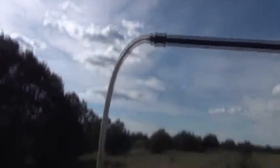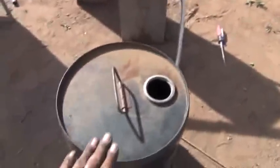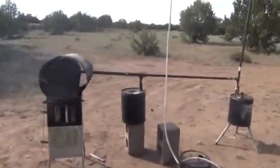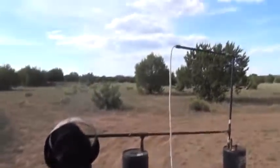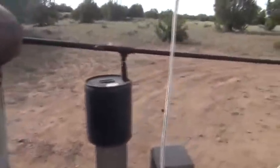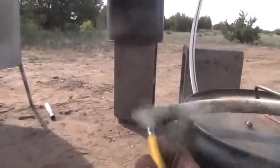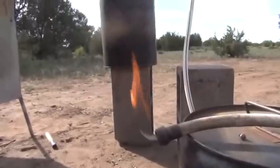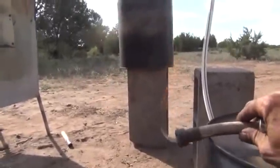The rest of it goes up, crosses through the pipe, and comes down through a condenser — I'm going to fill a can with cold water and a coil inside of it. Hi folks, Mr. Teslonian back here again. I finally got the bio crude system fully completed. I'm going to explain what I've done to complete the system, show you it in action, and at the end show you some of the crude oil we've collected. Later I'll show you how to refine this crude oil into fuel you can use in any engine. I've already explained the big pipe in the background and the first two collection jugs. This is a downhill pipe going anti to the direction of natural thermodynamic processes — that helps condense out or precipitate out some of the oils at a much faster rate. So we have our first catch here — this will be the heaviest and thickest of the crude oil.